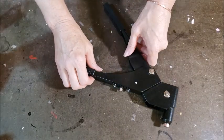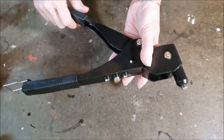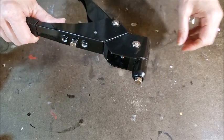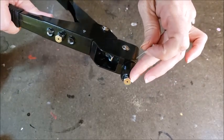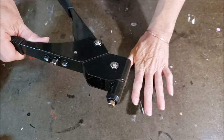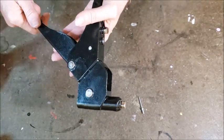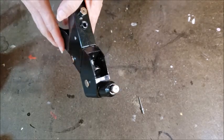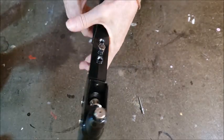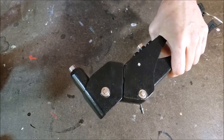I've already mentioned that I'm not a professional at using a pop rivet gun. One of the problems that you can have is that the pop rivets will slip — something happens inside and the gun won't hold the pop rivet in, which doesn't allow it to compress the rivet. I had that problem with this gun and since it's very inexpensive I was ready to just replace it. I looked into it and found a lot of complicated repairs involving springs, which was quite intimidating to me.